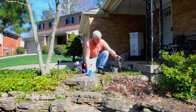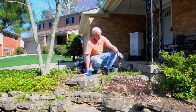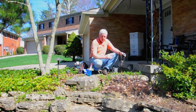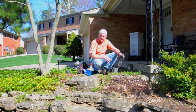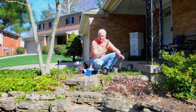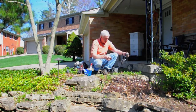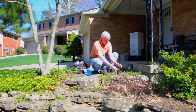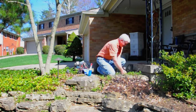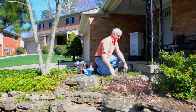As I got this one out of the ground, another thing to look at: sometimes bushes grow and you need to move the lights. Most of the time, if the lights are installed properly, they're going to have a little extra wire on the base so you can move them to different locations. You might have to move the wire back away from some bushes to reposition it on the house. You can pull the stake up, figure out where you want it positioned, take the stake, and push it back down in the ground to reposition the light.